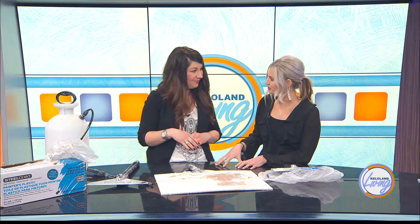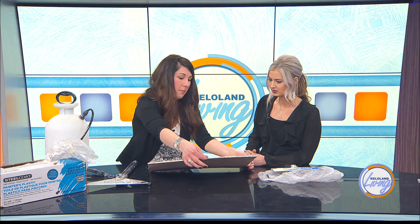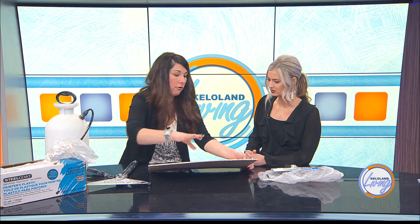With the shiplap, are you using regular wood or white wood? There are a couple of different ways depending on your budget. If you want to keep it really cost effective, you can use quarter-inch plywood — this is actually just quarter ply shaved down into whatever width you want, from a four by eight sheet, and Home Depot will actually do that for you. Otherwise you can get actual shiplap — they have pre-painted shiplap at Lowe's — and you just tack that on. Shiplap kind of sits together and overlaps on top of each other too.